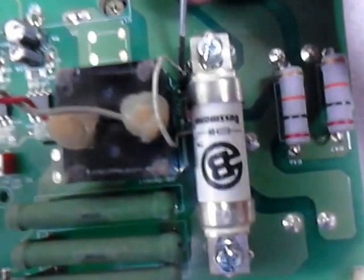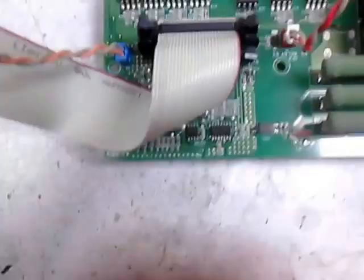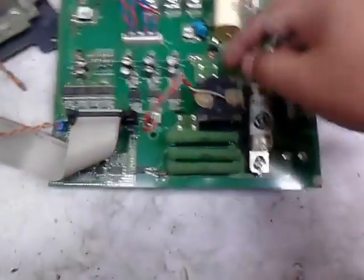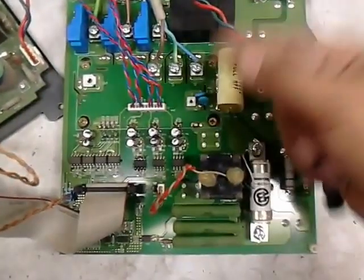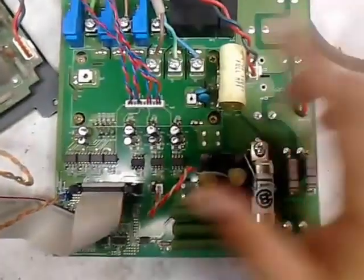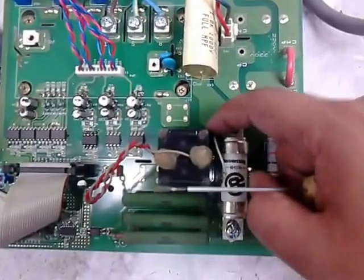remove the cathode of this diode, which is right near D3, near your fuse. What it does is simply sense the fuse. If the fuse is broken, then it will give some feedback using this resistor, and this is the path. So using this optocoupler, it will simply give a signal to the drive, the microcontroller, that the fuse is broken. To trick it, we have to simply short this output to the 220, so it will sense the fuse is not broken, while we will save our module by stopping the positive supply to the module. Even if we fire or put the probes of the oscilloscope, the gate will not fire itself and the module will not get damaged. So to save your module, you have to either remove the fuse, but it will give an error, so to bypass that error, you have to do this trick.